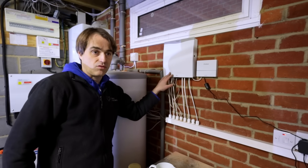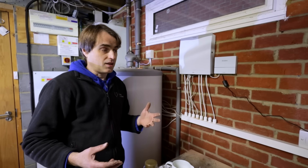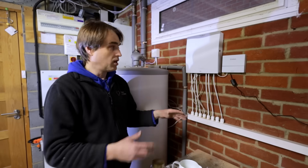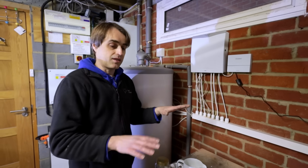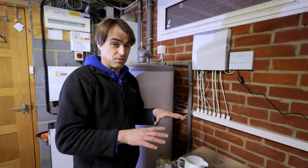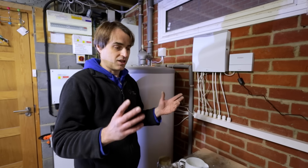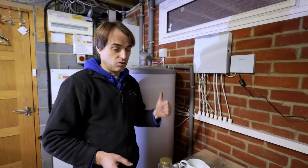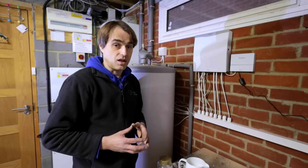Wiring VR71s or VR70s Vaillant controls is much more difficult than just doing a standard S-plan. That's why people don't want to do it — it takes time, effort, and a lot of trial and error. When you quote for jobs, you might be a few hundred pounds more expensive for an SB valve. However, it all balances out because you don't need actuators or tons of Heatmiser controls. The cost is probably comparable — it's more about the effort it takes to learn new things. People don't want to learn new things; they want to be stuck in old ways that belong to the last century. So if you install Vaillant boilers, don't do your customers a disservice — install Vaillant controls. You'll have much happier customers and you'll become a better engineer yourself.